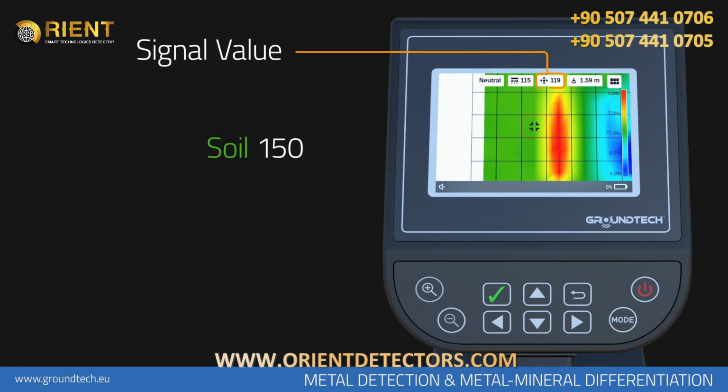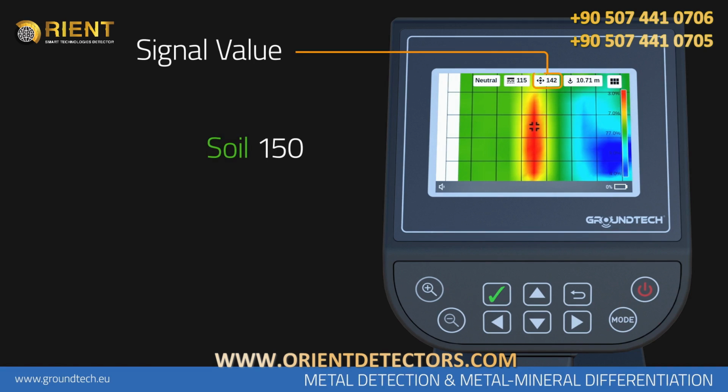For example, if the level of soil is 150, there should be a numerical value of at least 165 to 170 in order to be a metallic object present. If there is a difference of a couple of units, this data indicates mineral. A few units of increase are also possible for new objects that have less magnetic effect and have not been underground for too long.